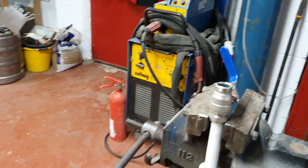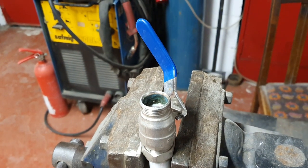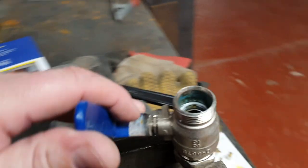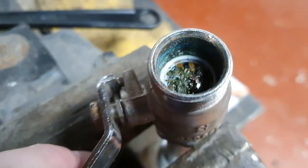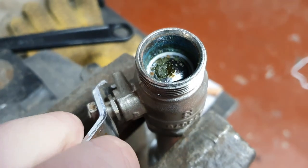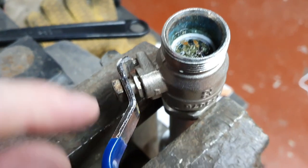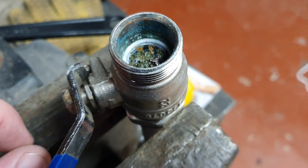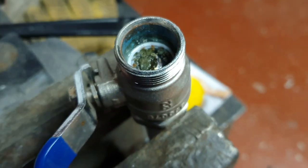We have arrived, and the first thing I'm doing is replacing that leaky valve I showed you on the other video last week or so. Now, these ball valves are just from Tool Station. They're cheap for water and gas, but if you have a look inside, just look at the condition on that side of the valve, because it's been exposed to PAA, and peracetic acid will corrode soft metals, and it really kind of has gone to town.